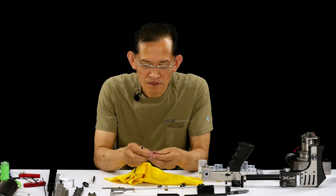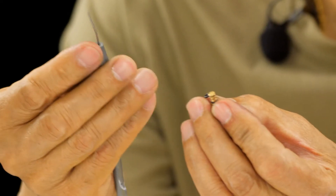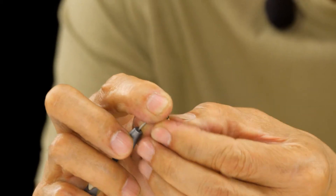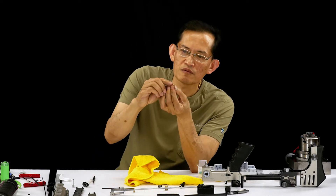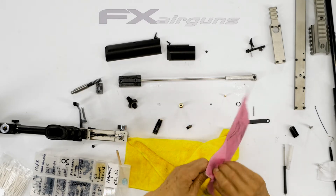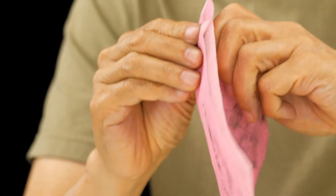Now we're going to remove this o-ring. It can be very difficult, but with this little teeny pick you can get underneath it and lift it up. I'll put this on a lathe and spin it to get all the little corners of both o-ring grooves — make sure it's not sharp. I'll round that off on a lathe so the piece comes out shiny, clean, and the razor blade edges are rounded off. That way your o-ring will last longer.